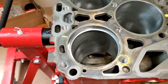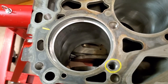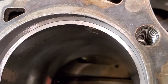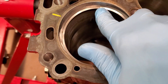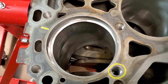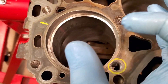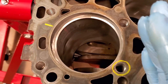Slowly getting it. The top ring finally made it into the cylinder, and you want your grinds to be totally straight and on point. As you can see when I zoom in, it's butt to butt. If you start grinding crooked, you'll have a gap that's not totally true, and your feeler gauge is not going to fit smoothly. So you want to grind totally flush in a straight line — not cocked to the left or the right. You want to be totally in line so that when this ring goes butt to butt, the gap will be exactly uniform with the feeler gauge.